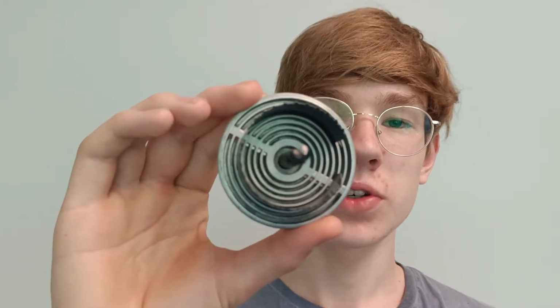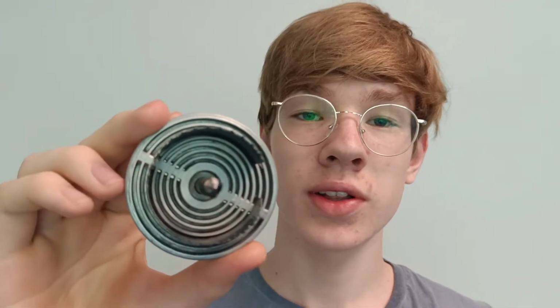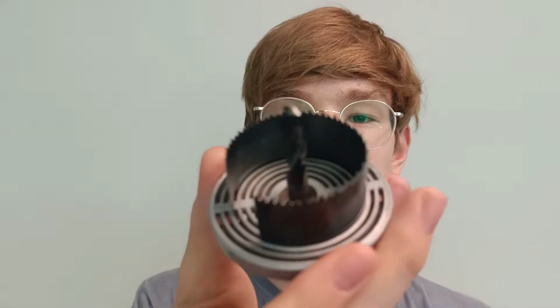Last time we started off with a 50 centimeter long tube and drilled a hole in it. We did that using this type of drill, which is kind of a saw to drill large holes in objects. You can see this one right here has a diameter of 50 millimeters, so 5 centimeters. And this is exactly the outer diameter of this cup right here. So we use this to drill a hole, or actually 4 holes, in the tube, and then use a file or a knife, you can take what you want, to cut in the eccentricity to get something elliptical, so that the couplings, or the cups right here, slide in at an angle of 45 degrees.